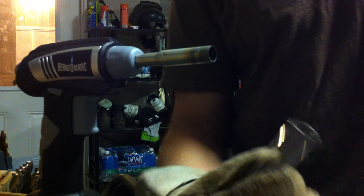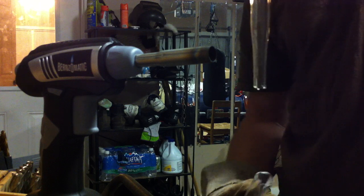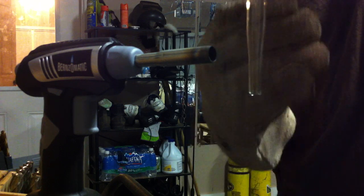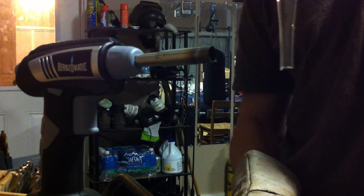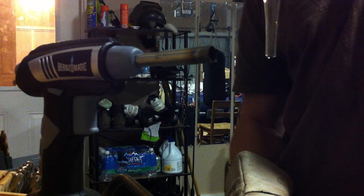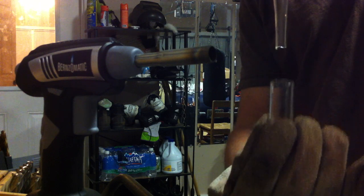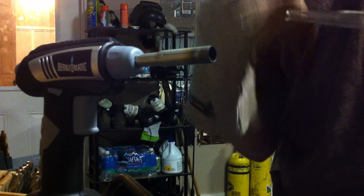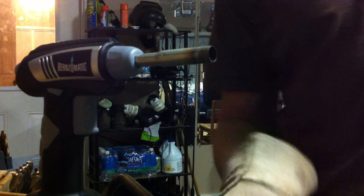Now, to actually create a draw, I would take a piece of tubing kind of like this, and I'd hold it in the flame, and basically let gravity do the work. It'll sit there and pull it on itself, and all I'm doing is just sitting there heating it in the flame, and then once I get it, I just kind of pull it away and keep moving it back and forth in a little circle, just keep it straight, and then let it cool down. Take a little file, make a mark on it, and then snap it where the mark is. It breaks clean. Then I just fire polished the ends just like I did with this one.